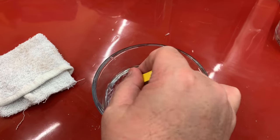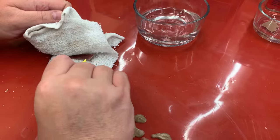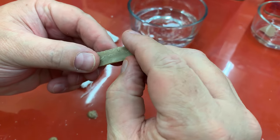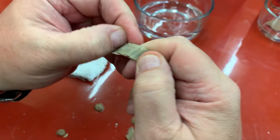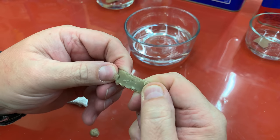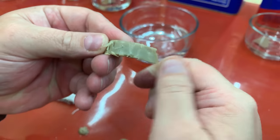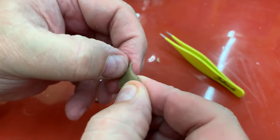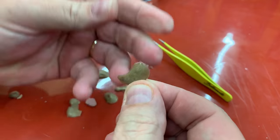I'm going to start with acetone here. I happen to know that this is one of the solvents that does react a little bit with the PVA glue, and we'll take a look at what it's done to it. We can see that the piece is much softer and with my fingernail I can actually tear the piece apart. It's pretty easy to pull it apart and scrape it because there has been some sort of a chemical reaction between the acetone and the PVA. It's changed the consistency into a softer, more rubber-like texture, which is going to make it pretty easy to get off the bars of the clamp. If we look at a piece of PVA that's been untouched, we can see it's still rock hard — no change, I can't put a dent in it, it doesn't bend, it's not flexible at all.